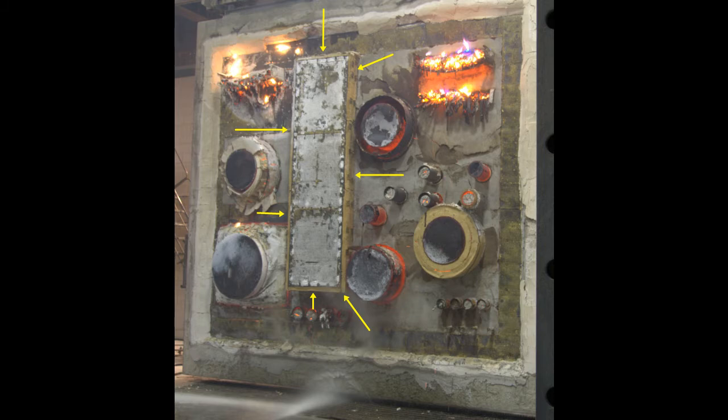And by putting that insulation onto the ductwork at the point of through penetration, the thermocouples are moved out of the danger zone, right? And then the thermal performance of that system can be misconstrued as applying to the whole duct. Well, this whole duct is uninsulated in this particular example. Same as in that guide, HNLN. They're talking about uninsulated ductwork, right?